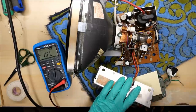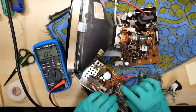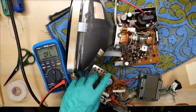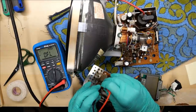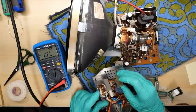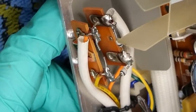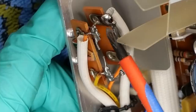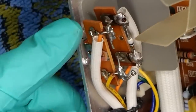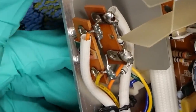I'm going to pull this off the PCB here. And we'll take a look at the fuse that's on here — there is a fuse down here. Well, that is good as well. There's a second fuse over here. I don't know why there are two, but there are. That is fine. Okay, I think I see the problem. Looks like this is a bridge rectifier right here. This right here is the bridge rectifier of the monitor. We have a diode here that's broken. That one's intact. In fact, these two are missing altogether. So you're definitely not going to get a working monitor when you don't have a bridge rectifier on the AC power supply.